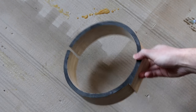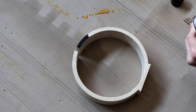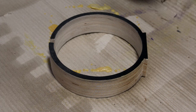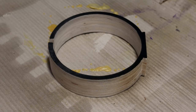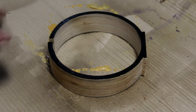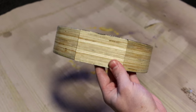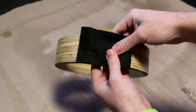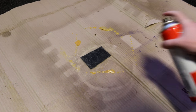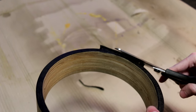After sanding, I decided to paint the faces of the plywood black just to make it look neater. It then got three coats of spray lacquer. I did not apply a finish to the base of the filler piece so the felt base will adhere a lot better. With a slightly oversized piece of felt base cut, I sprayed it with spray adhesive and applied it to the base. Once it was dry I trimmed it flush with scissors.